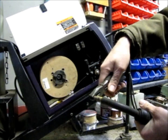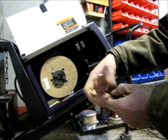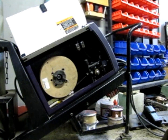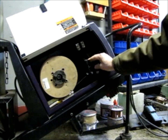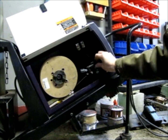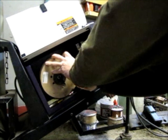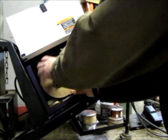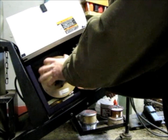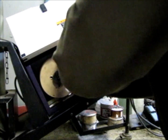And then I take and pull off my tip. That basically makes sure that my wire is free to come back out of the weld gun. Then I take and pop off my tensioner, lift this right out of the way, and start basically running the reel back in. You can take the tension off a little bit if you want — it makes it a little easier to turn. Then pull that wire right out of the gun.